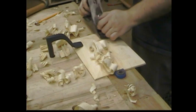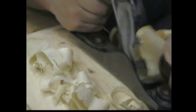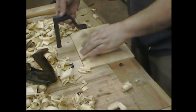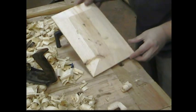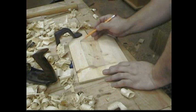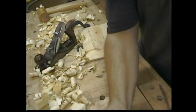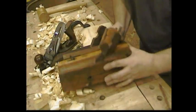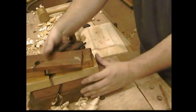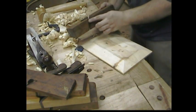This is my very first raised panel with a hand plane and my stock was kind of warped, but I'm pretty pleased with the way it came out. A little more work to even out the bevels, maybe some light sanding or scraping, and it's going to look pretty good. Some people like the center portion of their panel to be raised proud of the bevels. To do that, I would have cut some grooves with the table saw when I started out, then get out one of my rabbet planes — this would cut right up to a line rather than having an even bevel from surface to surface.